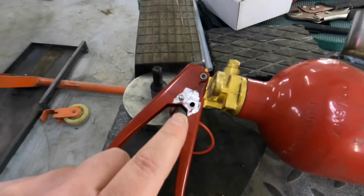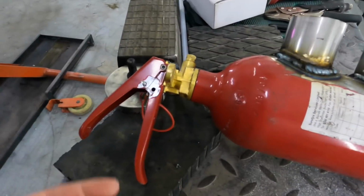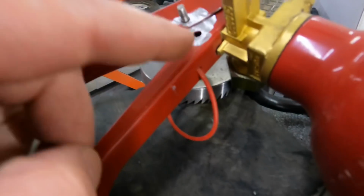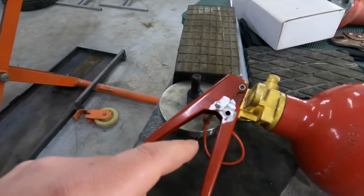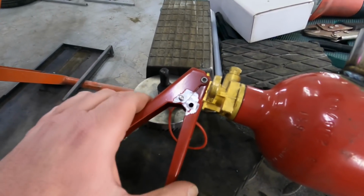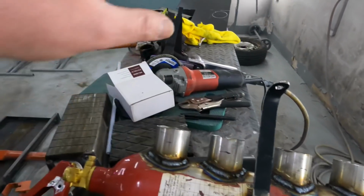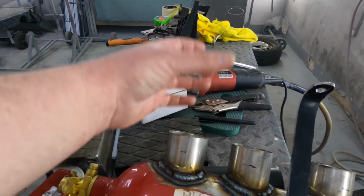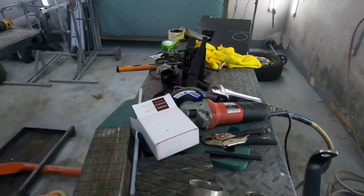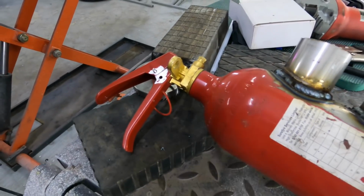Right, what we have decided to do is we're keeping this valve, so obviously without a pin in, you press it, it's going to actually open, so we don't want it to open, so we're going to weld the pin in so the pin can't come out, if that makes sense. So we're going to do that, give that a little tack, and obviously we don't want that rattling around in the engine bay, so I'm going to weld the pin and then we're going to weld the lever to itself, so it's just fixed, and then when it's in the bay, this bracket is going to go to the bottom half of the manifold. We're going to have silicone hoses connecting to that part of the manifold over there, and this will be a support and bolt on through one of them bolt holes. So this will all be sturdy and solid. We're going to stop this rattling. Let me get this welded up now, and I'll see you in a moment.